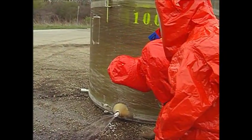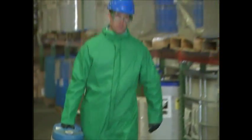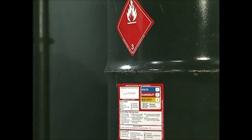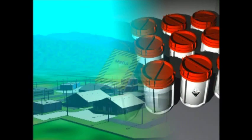If you work with chemicals, you too need the eagle's alertness to watch for hazards. That means being aware of what you're working with, how to safely handle chemicals, and what to do when there's a problem. Chemicals can come in solid, liquid, or gas form, and their hazards vary. Each container must have two labels — one identifying the contents, and the other to describe the nature of the hazard. Before handling any chemical, it's better to check with the Material Safety Data Sheet, or MSDS.